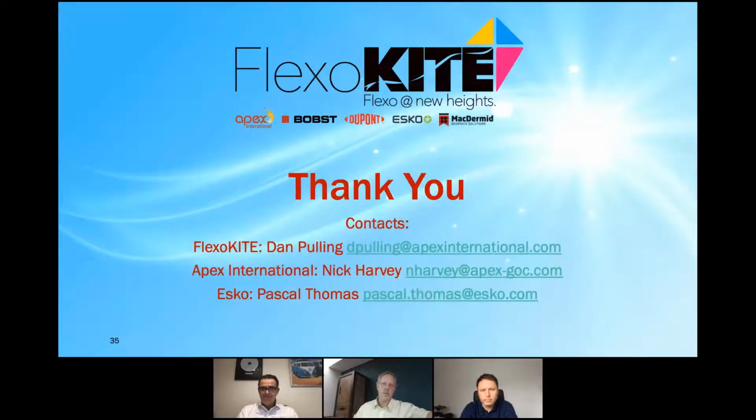Yeah, there was also a question about what would be the best volume for the anilox, but I think that's going to be really a combination of the plates, if you're using a surface pattern, and the opacity requirement that you need to get for the customer, right? Yeah, I think you've got to look at what's best. The best for the printer and the converter is 2 cubic centimeters volume, because he's going to use almost zero or very little ink, but it's going to fail in the other areas.